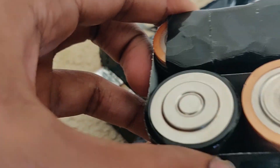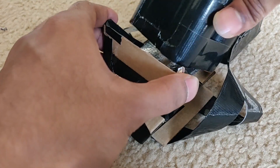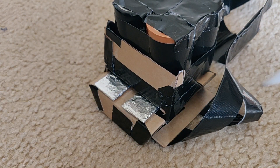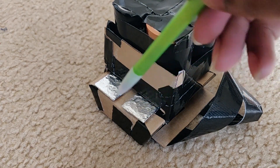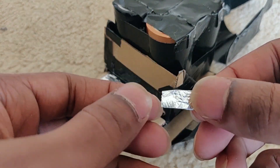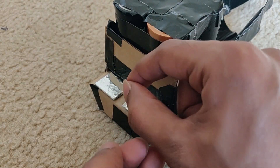To power the railgun, I used four D-batteries. This equals about 6 volts, and luckily D-batteries have low internal resistance. This allows a pretty high current to pass through the rails. The magnets, the D-batteries, and a relatively low-mass projectile helped me achieve a decent bit of acceleration.